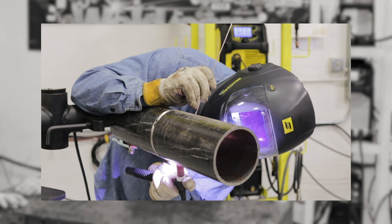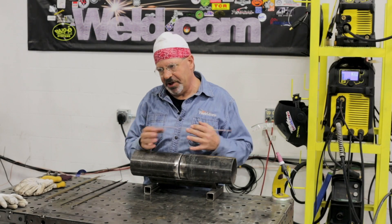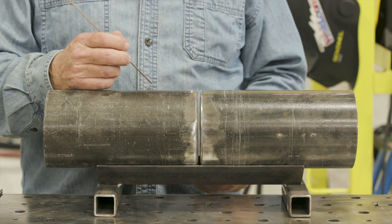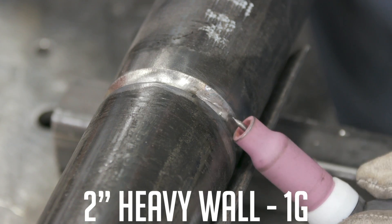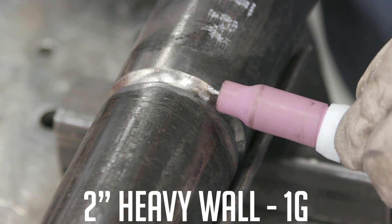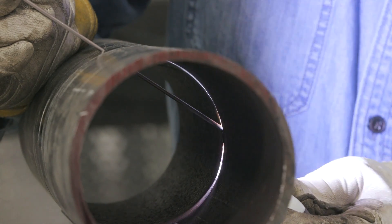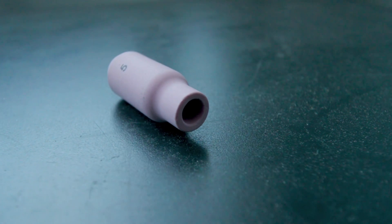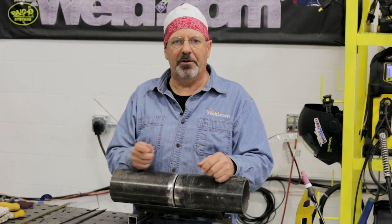We're going to do a series of pipe welding videos on four inch schedule 40. This particular one is going to be the intro, get-you-started type thing. We're going to kind of roll this out. We're using a smaller v-block over here on the table so we could go a little bit more than quarters. On the small bore two inch pipe we did it in quarters, but this one we can actually reach a little bit lower. My fit is going to be a loose 3/32. I'm going to use a number five cup and we're going to put roots in today. Let's get some gear on and get going.